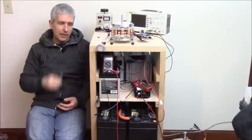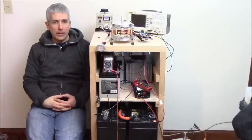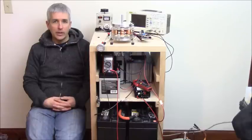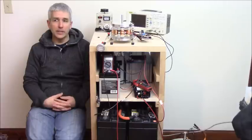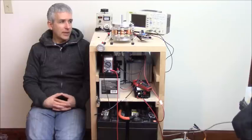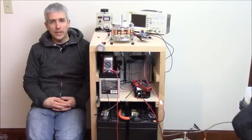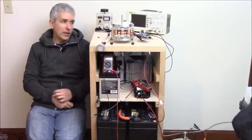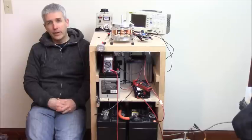But there's a limited number of them, and they can get pretty pricey if you're going to try and do the really fast switching, like down to 4 nanoseconds, and the higher amperage and higher voltage. They really peak off at 1700 volts. And these are the silicon carbide diodes, the SiC, not just the Si, both for the diode and the MOSFET.